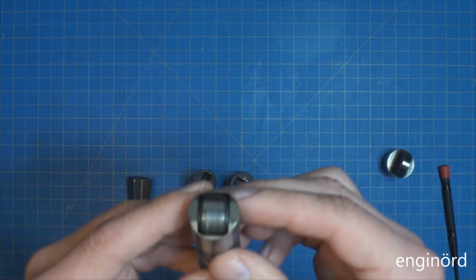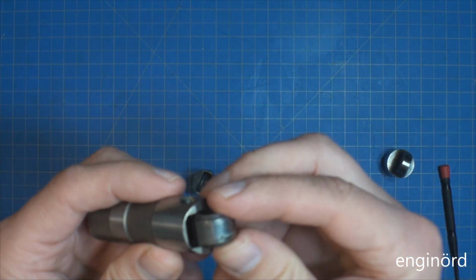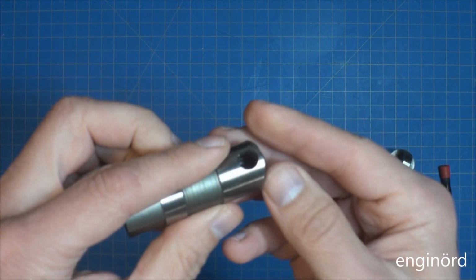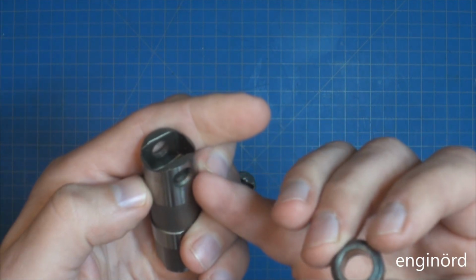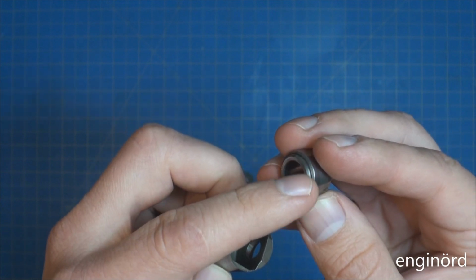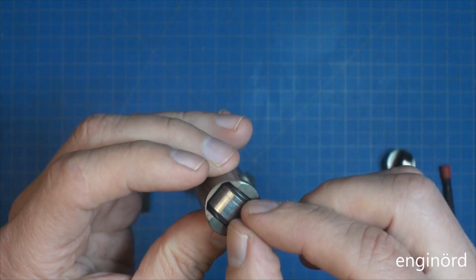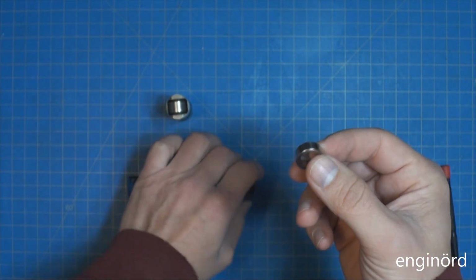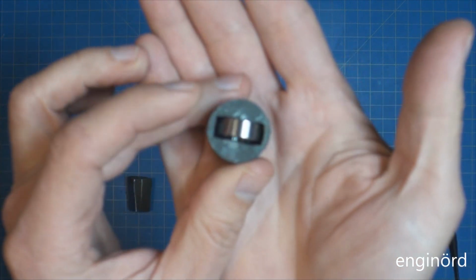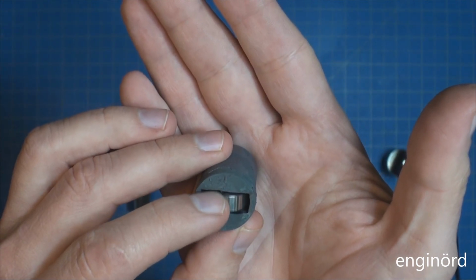I found something here that I did not consider before. This is the tappet from the Harley, and you can see the roller when I put it in has a little bit of axial play, but not much. Why is that important? Well, because there's going to be a pin in this hole. There are a plurality of rollers around the pin, and those rollers can march out if there's a lot of axial play. And right now, if I put the roller in, you can see that mine has more than a millimeter of axial play. I would say it's 1/16 of an inch or 1.5 millimeters.